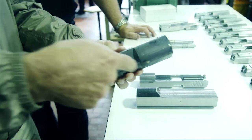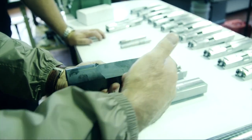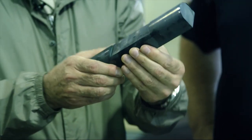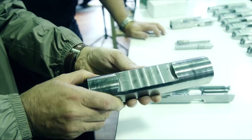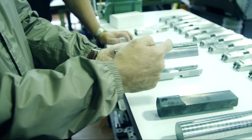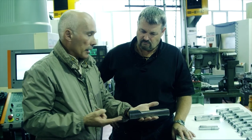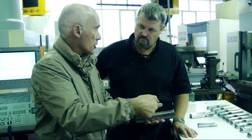Then there is a first machining, squaring, and the larger portion of the underside of the slide is removed. Then it goes through first annealing. Again it is squared, checked, and rectified because of any bend. A dovetail is made here to hook the phase one for the major drilling of holes, emptying inside, rail creation — all the phase one inside work, the mechanical part. And this is the first three phases.